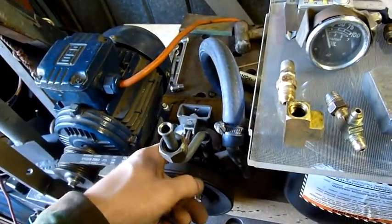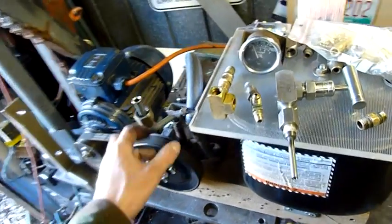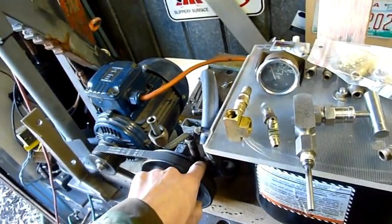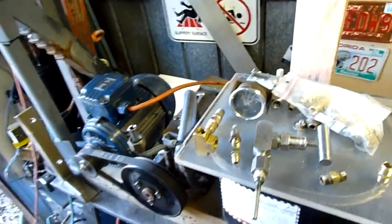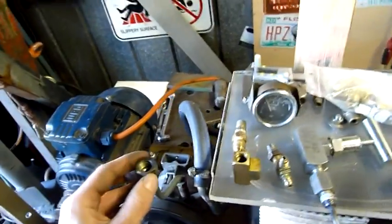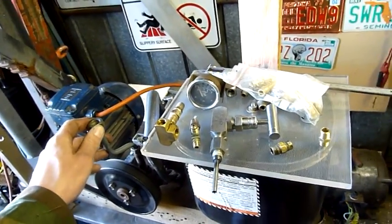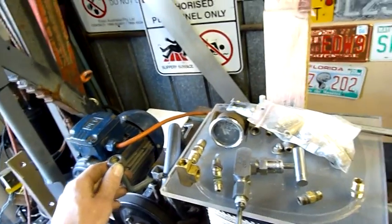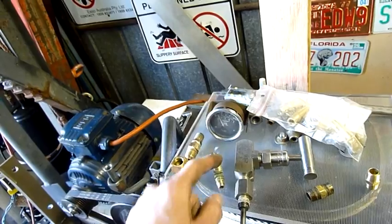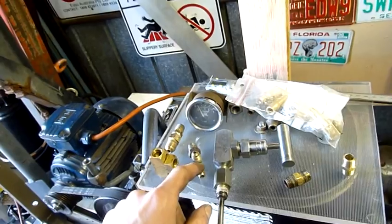I don't want the filter and oil cooler to exceed about 80 psi - certainly don't want it getting too high or things start to go pop. The output orifice from this pump - I've had it out and can't really customize the unloader too much - I've weakened it off a bit, but the output from the unloader is like 2.5 millimeters going into this big line here. So it's already restricted; it would have to have a serious obstruction to build pressure uncontrollably. Combined with motor speed control and an over-pressure switch, that's going to be on there.